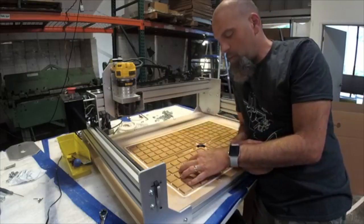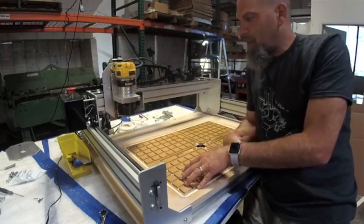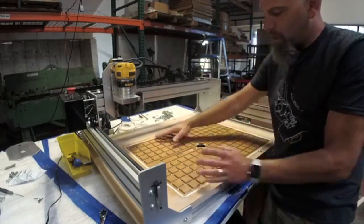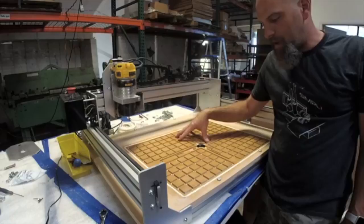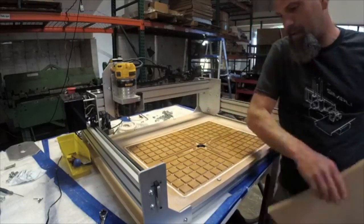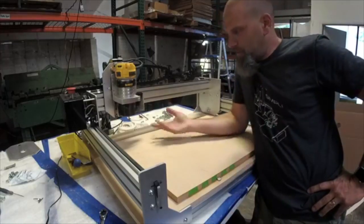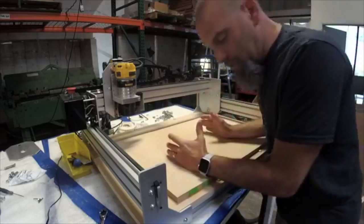What I really wanted was a vacuum table that people could opt to cut themselves. So this was just bolted down, and we made sure we had enough reach on this — it goes down far enough to actually route its own vacuum table. So we did this grid and we'll release these files — you can do it yourself if you want. We were testing this as a vacuum table. The idea of a vacuum table is that this base never gets destroyed — ideally. Then you put your waste board on top.